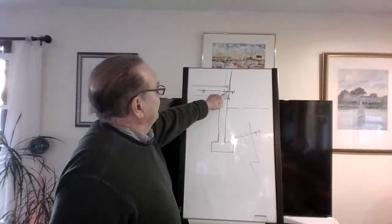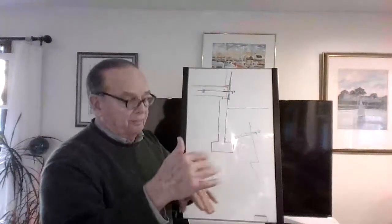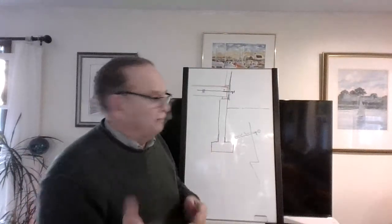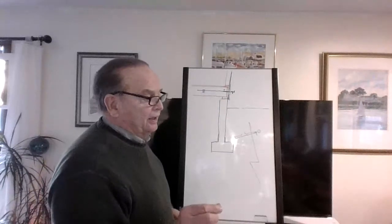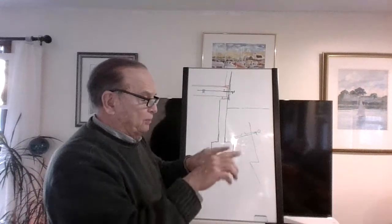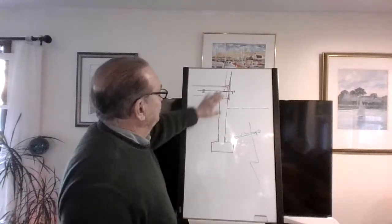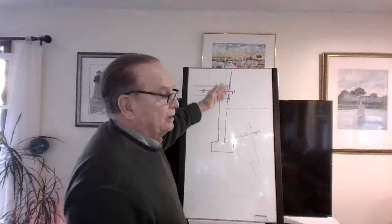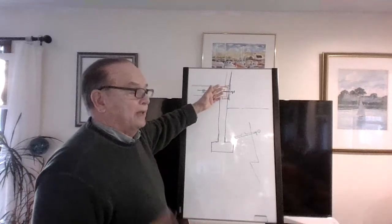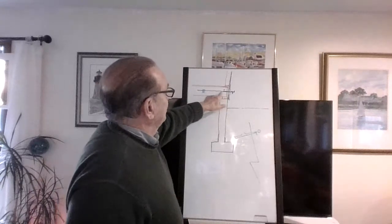But what about this part right here? Okay, first of all, you always put it in the middle of a shingle or the clapboard or whatever you got there. If it's vinyl siding, the stuff is wafer thin, and that can be a problem. You might even have to put a plate there, make something out of wood or whatever. But we're assuming now that it's solid. It's either shingle, clapboard, or those plastic shingles that are very expensive, but they're solid. Okay, so it's going to look like this.